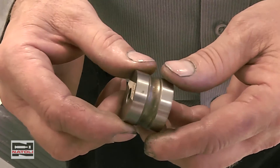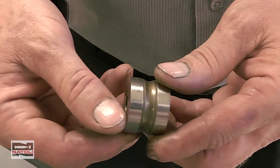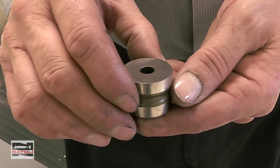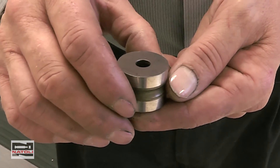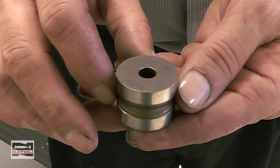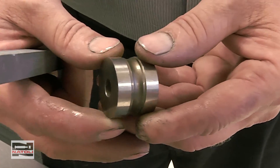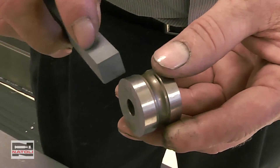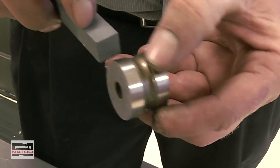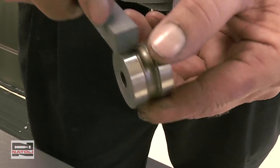As we talked earlier about J-hook and the die — the die can be mishandled and burred up. With little burrs on the die, when you install it back into your die table, it starts shaving the die walls, making them larger. When you seat the die and lock it with the die lock screw, you're throwing it out of center. Handling of the die is very important. If you do have burrs on your dies, take your stone and get the burrs off before reinstalling it into your die table. This decreases the possibility of wearing out the ID of your die table, which could cause it to go out of spec.